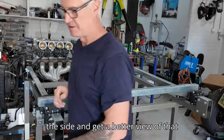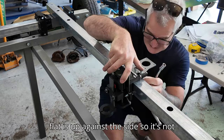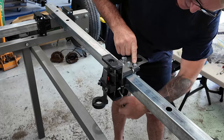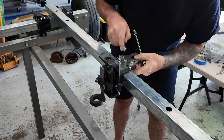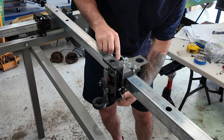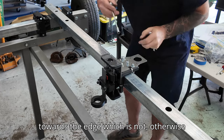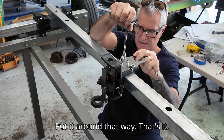I'll move the camera around to the side for a better view. With this you've got to square it up and make sure the standoff flat is up against the side so it's not touching. Tighten up a bit with a ratchet first until it's ready to slide across. Hold the spanner on the bottom and the ratchet on the top. Make sure the standoff flat is towards the edge - otherwise it will rub on the gantry rail.